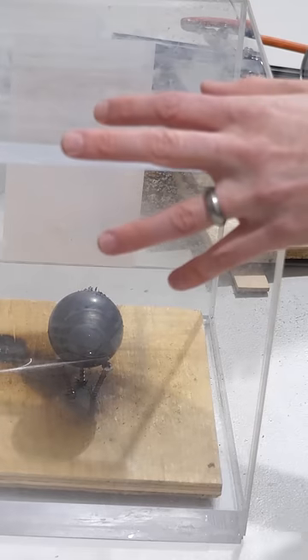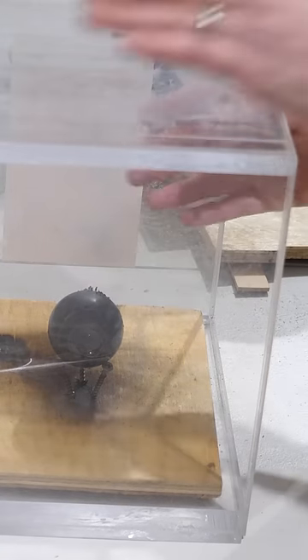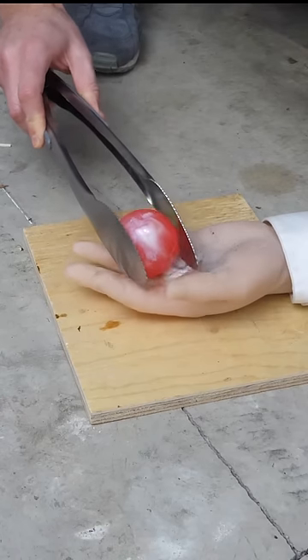Well, the ball's giving off electromagnetic radiation, and this radiation needs no medium to propagate. So it still transfers its heat to the chamber walls, even with almost no air present. In fact, the radiated heat is proportional to the fourth power of the absolute temperature, so you get a huge increase in radiation with only a little increase in temperature.